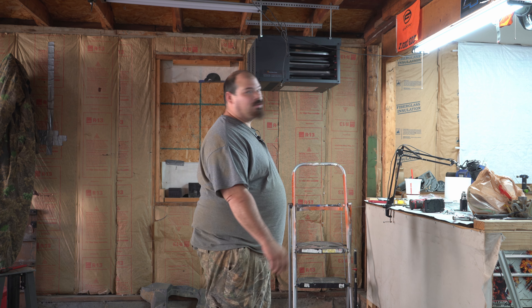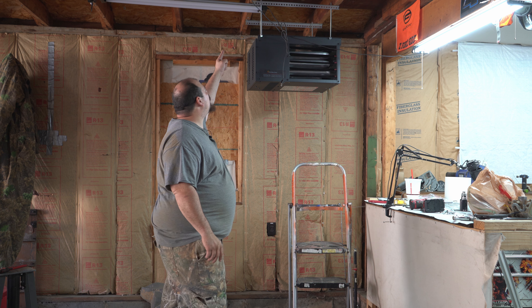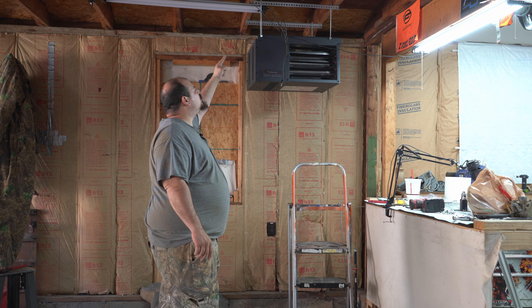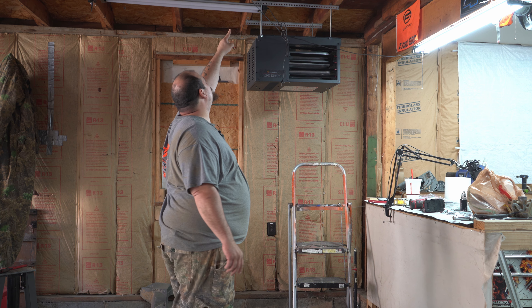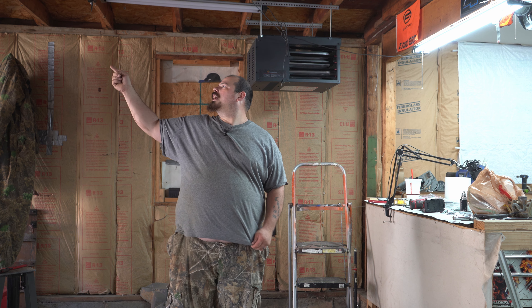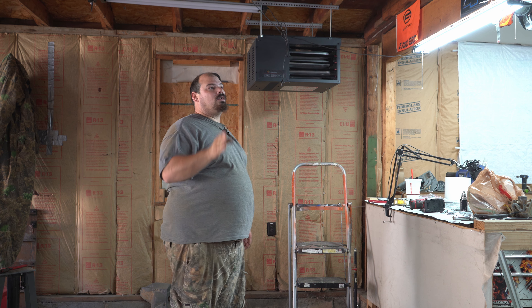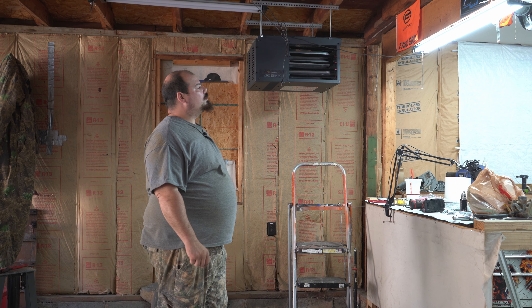Leave me a thumbs up if you think I'm doing okay so far. We got wiring to do and we're gonna do it all professional and stuff. I may have to move that light. I'll probably put the cord in this outlet or something. See, those outlets are all switched — like we talked about the other day. I'm gonna use the outlet for the garage door openers because they're not switched and they're on their own circuit, so I don't have to worry about messing with these lights. Without further ado, let's see if we can hook up the gas line.